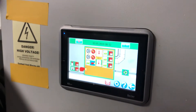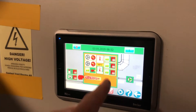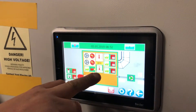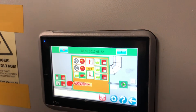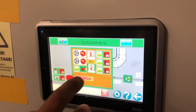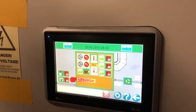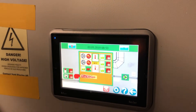We'll have the lower temperature setting for the electric elements — I can show you the set point. There are two buttons in the middle here. One has set point 75, that is for normal operations when you only need a little bit of heat. But if you need more heat, instead of changing the set point, you just push this top button — this is up to 95 degrees — then you will get more heat.